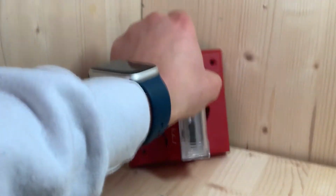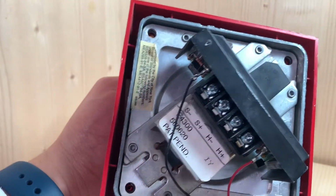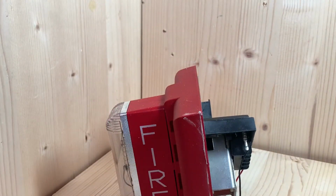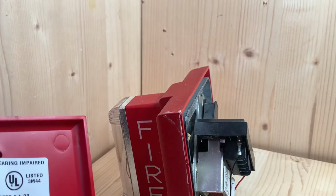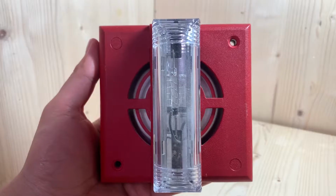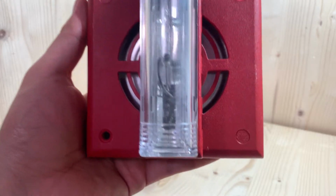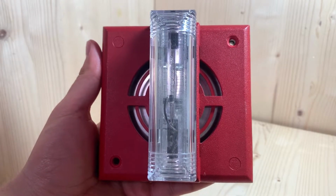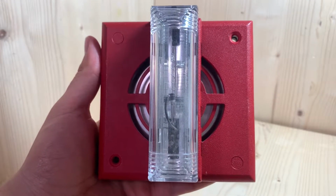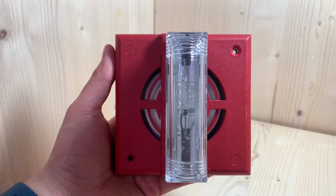So the way you would do that is you come around to the back here, and you'd remove this mechanical horn, and you'd see 2 tabs at the top and bottom, pop those out, and then you take your GXS, you pop these 2 tabs out, and you can actually swap strobes with your Gentex GMS. Taking a look at the face of the unit, you'll notice 2 mounting holes in the opposite corners. However, if you zoom in on this bottom corner here, you'll see this fake knockout. That's actually, according to Gentex, a beauty plate, and you can punch those out and switch those around according to how you mount this on the electrical box, so you don't have extra holes being left uncovered.